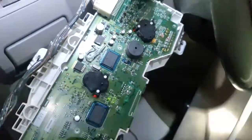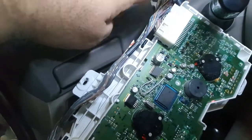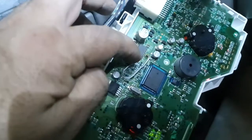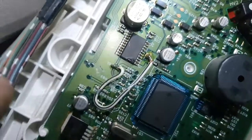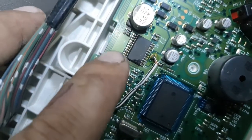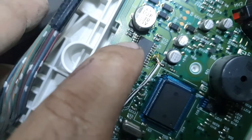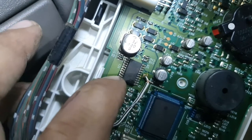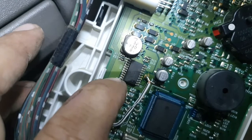When I tested it, there was a problem with the 5 volt supply. There is a power chip near the big connector — also a small connector — and power chip pin number 10 was not generating 5 volts. So I connected pin number 12 to pin number 10, because pin number 12 has 5 volts.